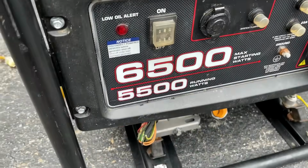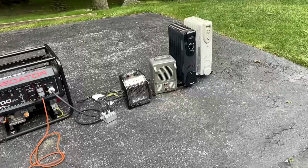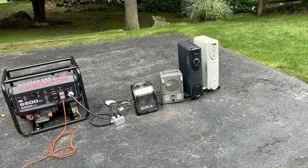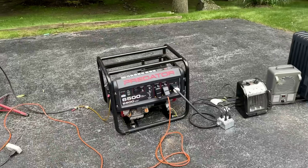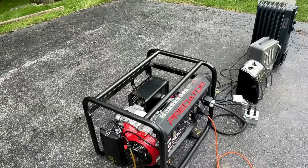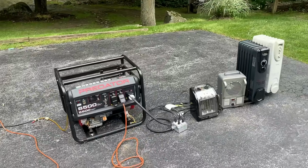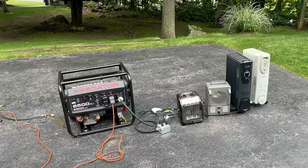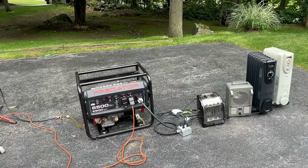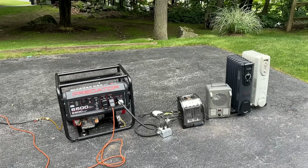The ants aren't too happy about what's going on here, and neither am I. You know, it's marginally better with the spring in that position, but the engine can't maintain speed. The spring just can't overcome the force of the governor. So, yeah, the engine's not down on power. It did smoke again pretty bad at startup, and it's actually been a few days since the last time it started. So I'm guessing it might be a valve stem seal, just letting oil get in there when the engine is sitting. But yeah, I got to give this one some thought.